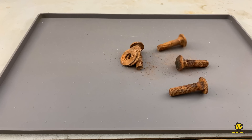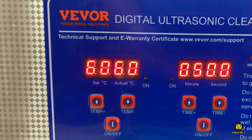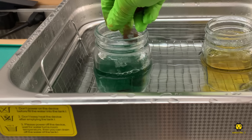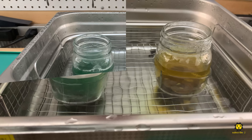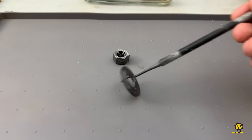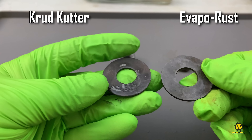These bolts and washers look ready for testing. We'll add heat to our next test but skip the ultrasonic function for now. The temperature is at 60 Celsius or 140 Fahrenheit, and our first test will be on nuts from the same rusted batch we used before, as well as rusted washers. This time we'll remove samples after 5 minutes, 15 minutes, 30 minutes, and 1 hour. We want to see how much faster the rust removers work with heat, and later, heat combined with the ultrasonic cleaning. Here's what we have after 5 minutes, with Crudcutter on the left and Evaporust on the right.